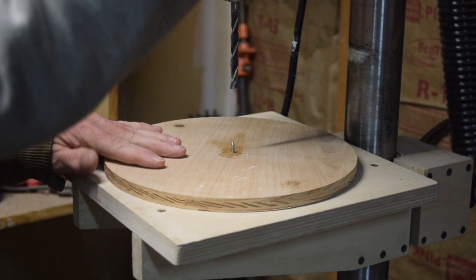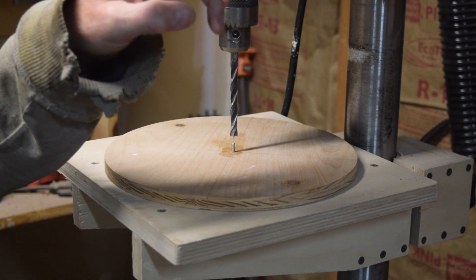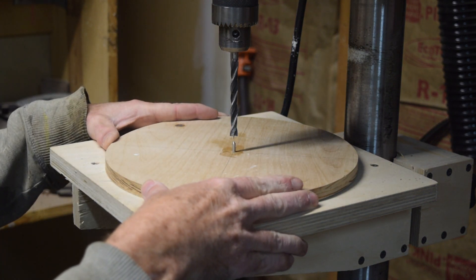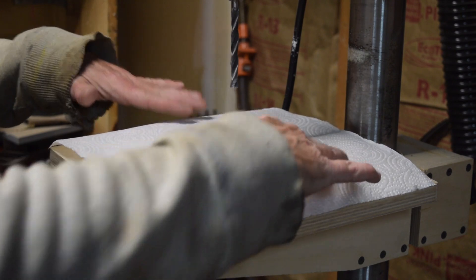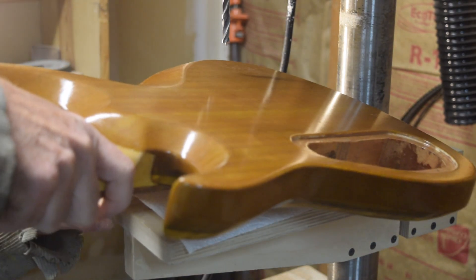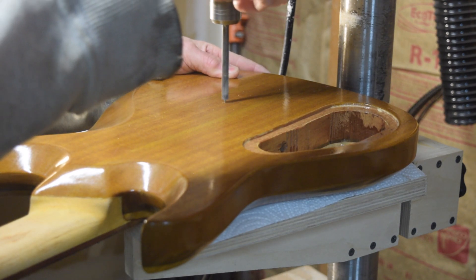Next I'm going to install a homemade pin guide drill plate onto my drill press. The goal is to position it so that the pin is directly centered underneath the point of the brad point bit I'll be using to drill the holes for the string-through ferrules being installed into the back of the guitar body. To protect the finish, I'll place a paper towel over the pin guide so the pin sticks up through it. I'm then positioning the body so that pin is inserted up into the string-through holes drilled through the base plate earlier.